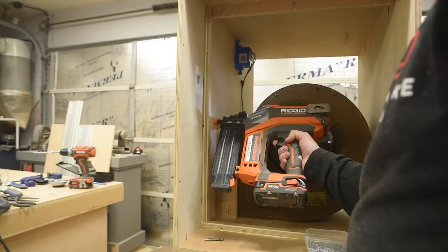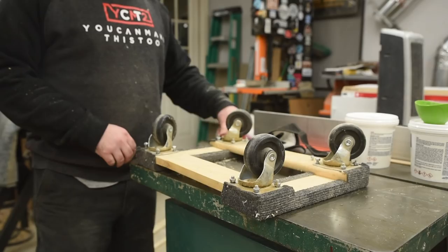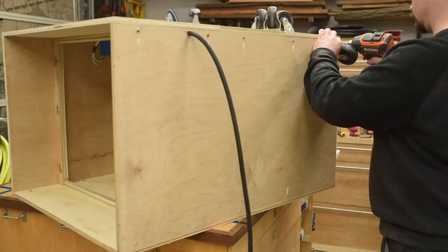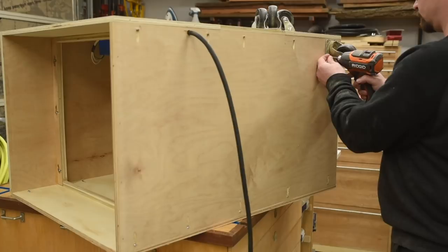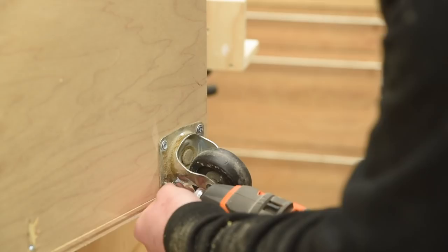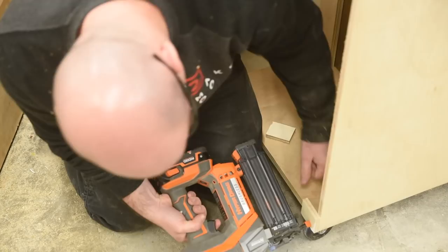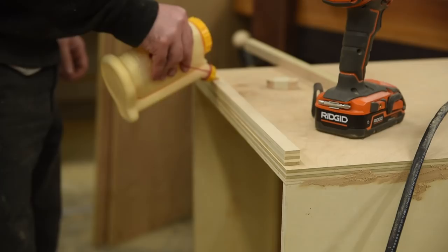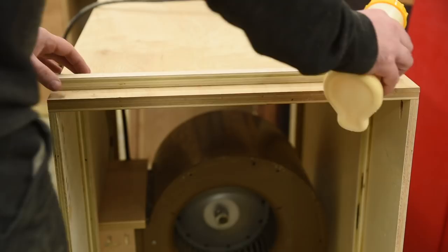For the filter stops, this is just scrap three-quarter inch plywood that I had laying around, so I glue it and then brad nail it into place. I'm a firm believer that stuff like this should be mobile, which means casters. Casters can actually get pretty pricey, so one of the things I like to do is pick up the cheap dollies from Harbor Freight when they're on sale and then just take the casters off when I need them — it's actually cheaper than buying a set of casters. The last construction is adding stops and tabs to hold all the filters in place from the outside. The tabs are actually some cut up paint sticks that I sanded down to a curve just to look a little nicer.